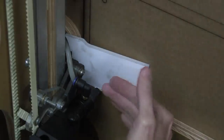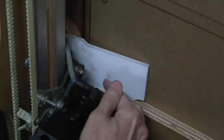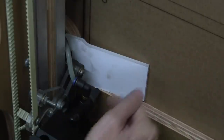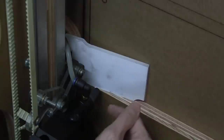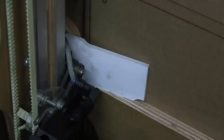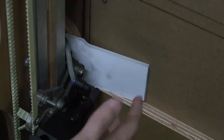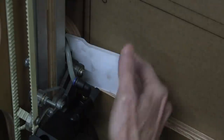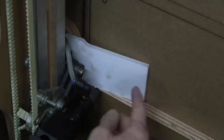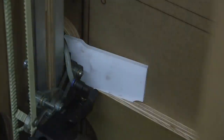The last test didn't have enough angle, so most of them cut all the way through. I want to show at a much greater angle so I can go outside of the tolerance of the beam. We're also using a plexiglass with a different protection layer — but actually we should use the other one to avoid introducing another variable. So we're going to try this one at a greater angle. Also, the previous rectangle cut was set at 100mm/s when it should have been 5mm/s, so I've changed that and the rectangle should get cut out now.